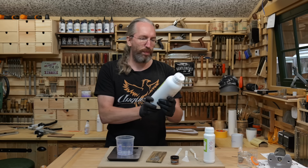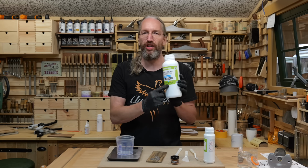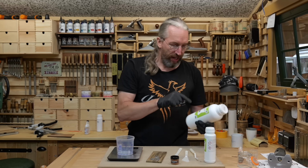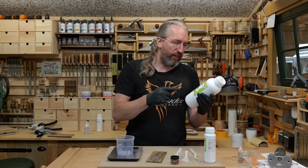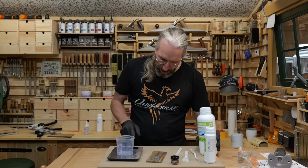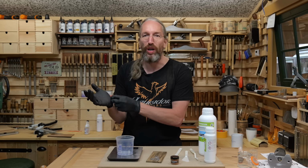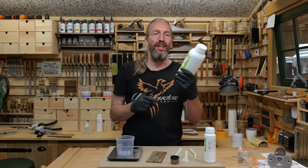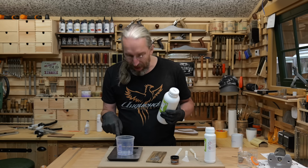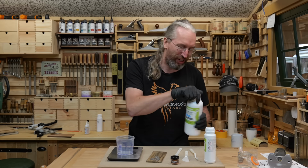And this resin should be mixed at a 3-to-1 ratio. So 3 parts resin and 1 part hardener. Weight based. I've learned that some resins are volume based, but these are luckily weight based. So I've got a scale. I stole my wife's scale from the kitchen. I really need to get my own scale if I'm going to work with epoxy some more, and I'm sure if I mess up this scale too much today, I have to go to a store and buy her a new scale.